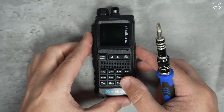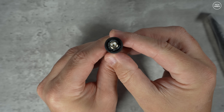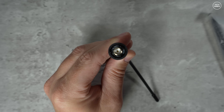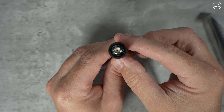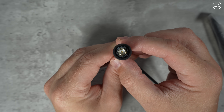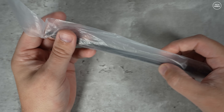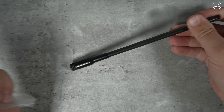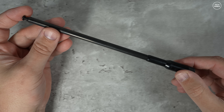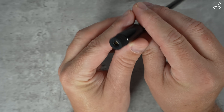I do understand that using a screw on a battery to hold it in place is acceptable if it's a waterproof radio. The VHF and UHF supplied antenna supports 136 to 174 MHz and 400 to 470 MHz — that's the kind of standard generic antenna they just chuck in the box. The other antenna included is for receiving HF using the HF port on the radio. This telescopic antenna actually feels quite nice and solid and extends to just over one meter in length.